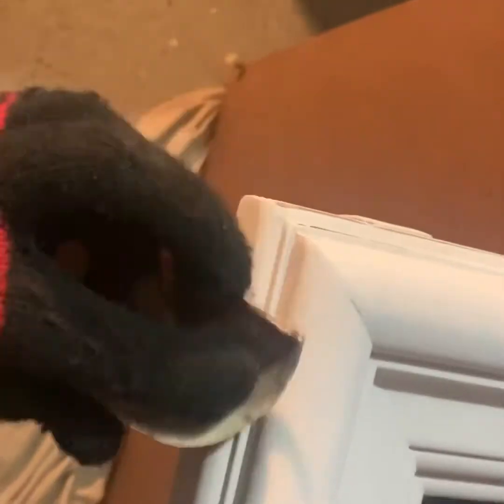So then the last step is just to go through and add some light distressing, and this is where that rustic farmhouse effect is going to come through most. Everyone does this differently, and you can just feel it out. Worst case, you take off too much and you just go back with a dry brush and put some more paint on it.